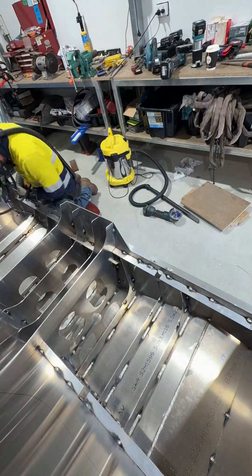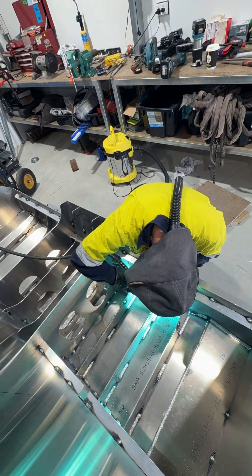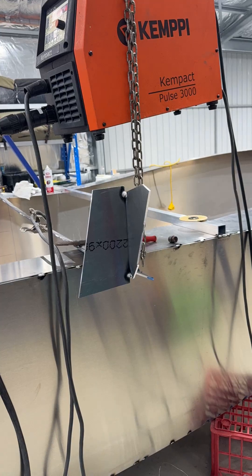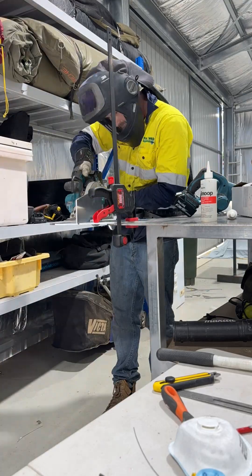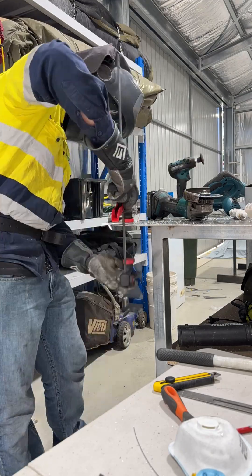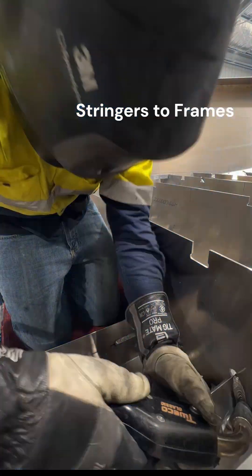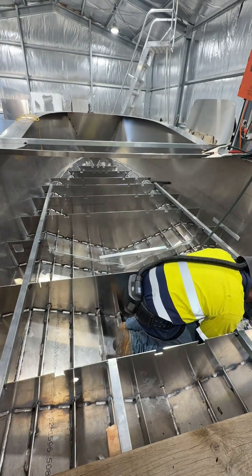Someone with more experience would probably get this welded up a lot quicker, but I was playing around with settings a lot. Every time you hear a tack break you go investigate, which is pretty scary — you're not sure if you're about to weld over something that's moved. For the vertical down welding on the stringers and frames I went with 30-degree downs, just to make sure I was getting enough penetration, and it just bit that edge nicely.